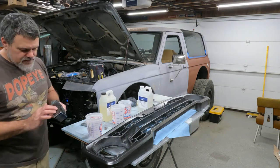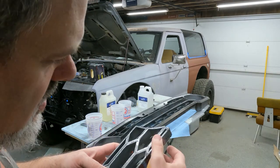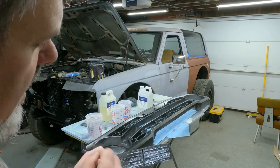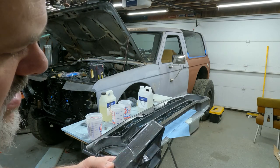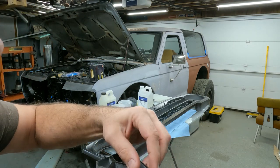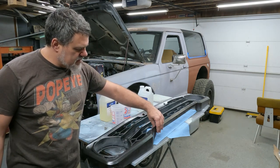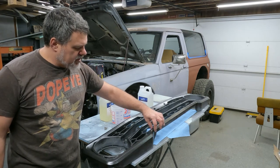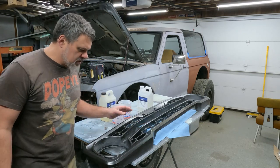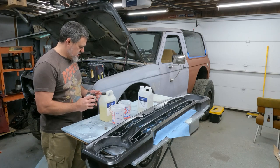So I did a test on the different stuff that's going together here. Here's the clear epoxy resin I put on yesterday over this paint primer and 3D printed plastic, and that's all come out really well. Nothing reacted. In the 3D print, I overlapped it, so there's a hollow on this backside, and then kind of a male and a female plug connection there to give it some reinforcement. That was all just super glued together, and then body worked to get the finish.